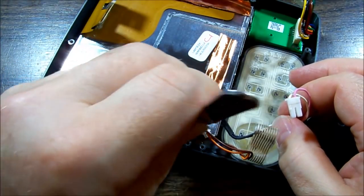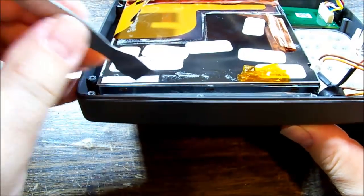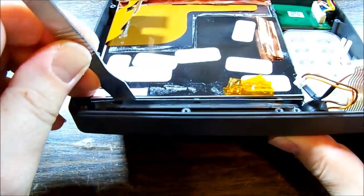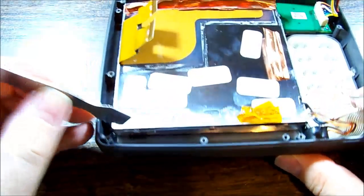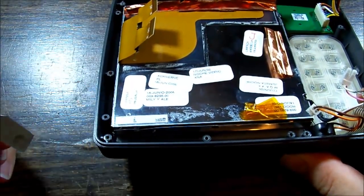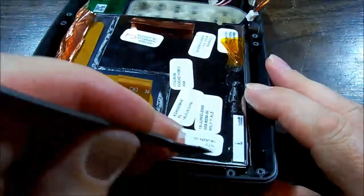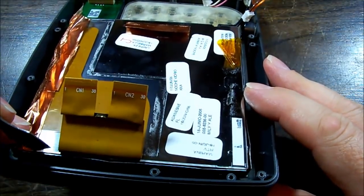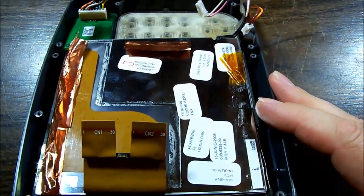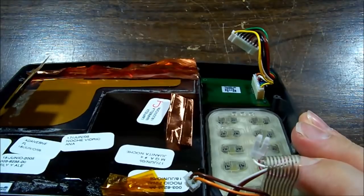There's another clip down in here. There we go, popping up. There's another clip there, which has sort of come up with the last one, so we can dig in and lift up that one, maybe. Of course, like I've just done, if you pull hard enough, it's going to bend this frame out anyway. It could be another way to do it, just bend the frame out. It's very soft metal, then straighten it all back up before you put it together, so that she all clips back in. That's mostly free now, so we should be able to pull it out, if I'm correct.